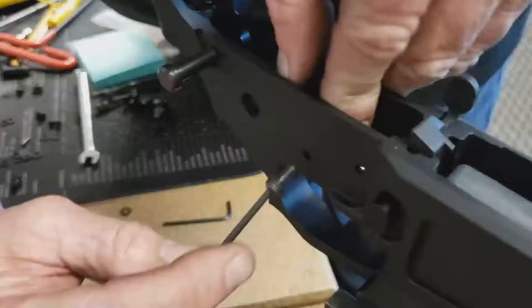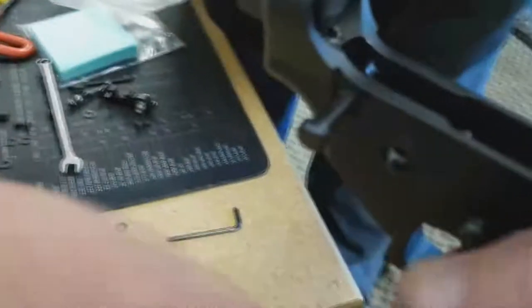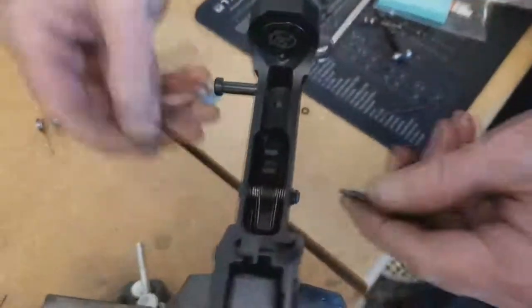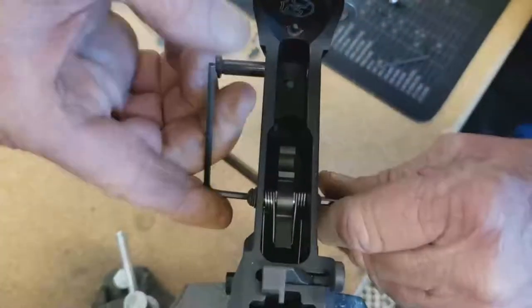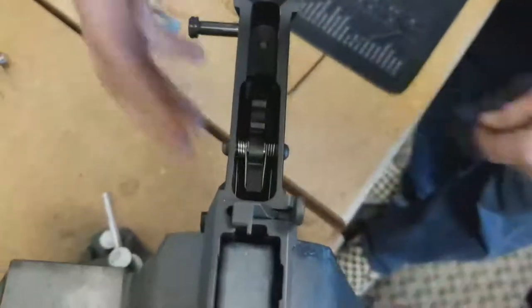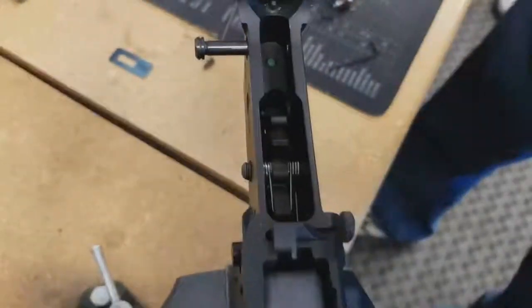It may spin and not tighten all the way, so just take your next screw. Look in the other side - you might have to push it a little bit. Now that's screwed right in too, no problem. Screw it down a little bit and take your allen wrench, putting one on each side. Now we're just going to firm them up - firm that one and that one.